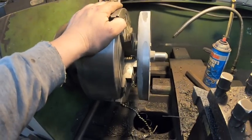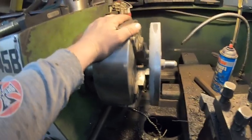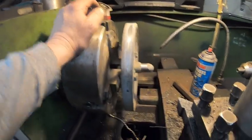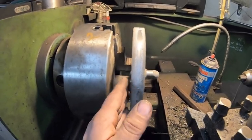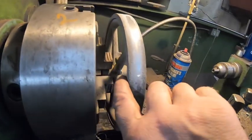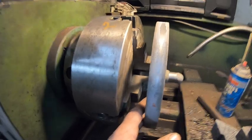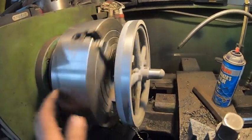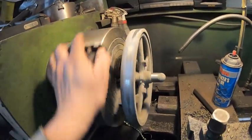I think my first model — I built a 12-inch flywheel but I did it on a 14-inch lathe, much smaller. I've never seen one on a big lathe like this, and there's no vibration at all. What I'm going to do is re-dial it, take it out, grab it here so I can do this cut and this cut all in one setup. I still have to check the depth for the pulley to make sure everything is true to itself.